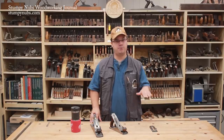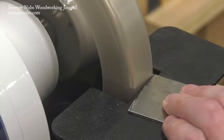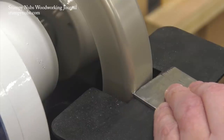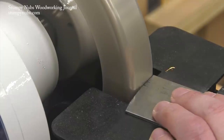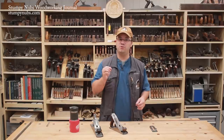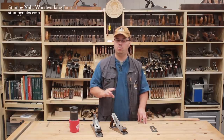I'll start with the rest at 90 degrees because I'm going to shape the curve before I grind the bevel. I'm working on one side at a time, beginning each pass in the center and turning the iron toward the corner. After the bulk of the steel is gone, I refine the curve with even sweeping arcs — you don't need absolute perfection, just try to get the curve reasonably even. I'm using a CBN wheel, which along with a large tool rest does an excellent job at keeping my steel cool. If you're using a regular grinding wheel, take very light passes and dip in water frequently. If you turn your steel blue, it won't hold an edge well.